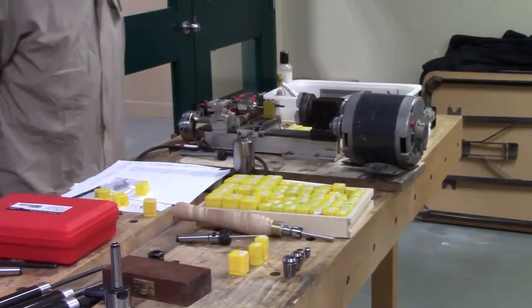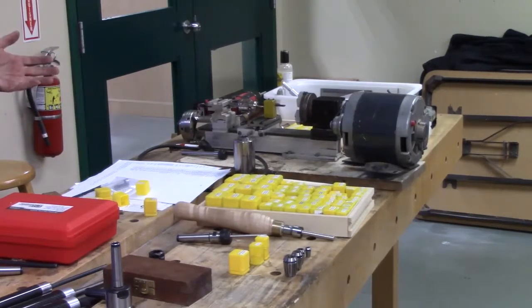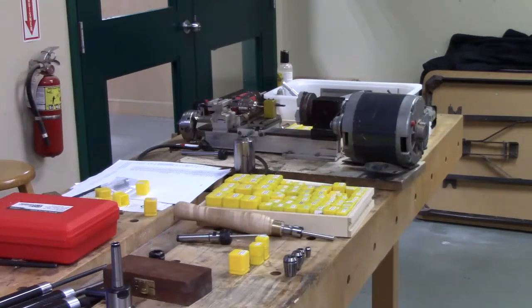That's one of the big advantages of collet chucks, is the repeatability. The repeatability of it, exactly. You can take it in and out and in and out, and it's perfect every time. Don't have to put any registration marks on it. The other thing about it is when you grip with this, it's a full circular grip around that metal, that wood. And so